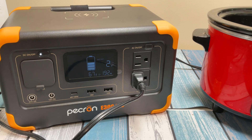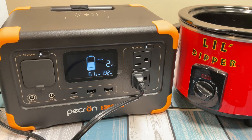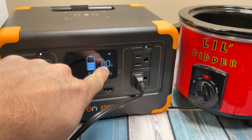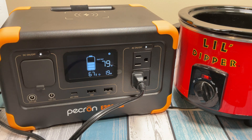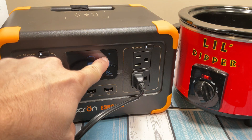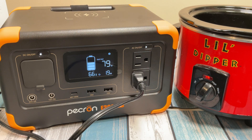I'm going to start by testing the AC power output with my trusty little dipper — basically a small crock pot. I'll turn on the AC power by holding the button for a second. You hear a click telling you it turned on, the fan spins up just for a second, and now it's ready. Let's turn this on to low. On the screen you can see an output of around 80 watts, and with the battery sitting at about 67% full, it's saying it will last about 1.9 hours running the little dipper at this power level. There's also a fan indicator on screen — there's a fan keeping the internals cool while the inverter is running. Now let's turn this up to high — now we're pulling about 128 watts, and at 67% full we'll be able to run that for about 1.1 hours.